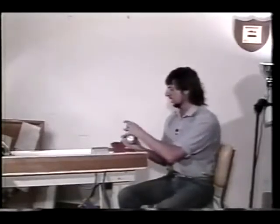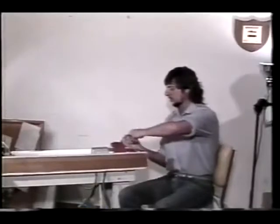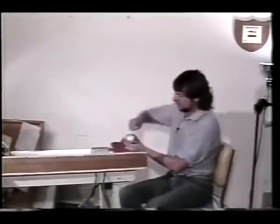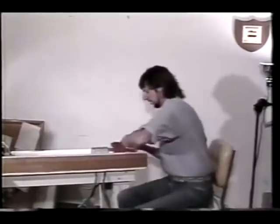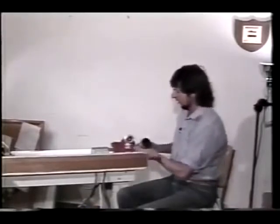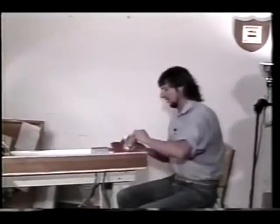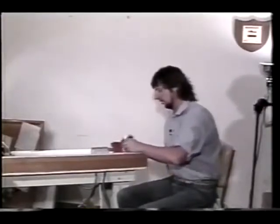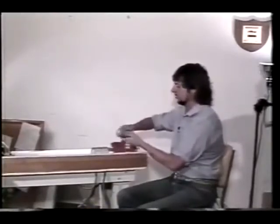Now this is pulling against the Kwikset clips which hold the interior cylinder in. There are two clips inside the lock. So as we screw this, we're pulling against those clips. We begin to feel tension, keep going, until you hear a crack or a pop. And you pull it out, and as you can clearly see, the cylinder of the Kwikset lock has been cleanly, without damage, yanked out of the lock and into our tool.